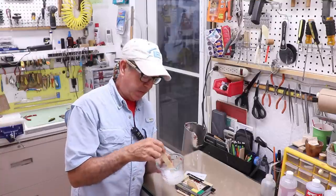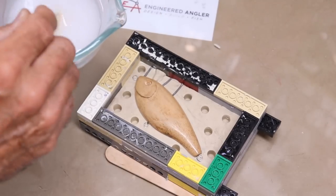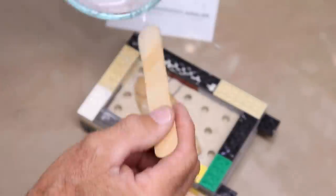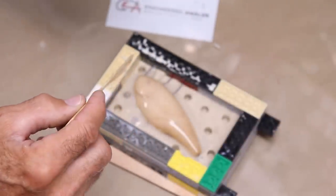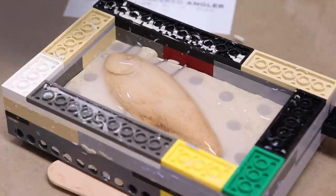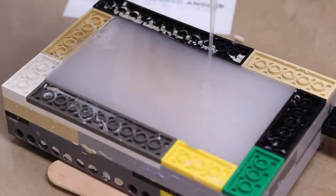Scrape the stick periodically to ensure everything is mixed and avoid any pocket of silicone that won't set. I put links for supplies in my Amazon store — look for that in the description. Have the mold as level as possible. Drizzle a very thin first layer on the body to ensure no trapped air bubbles right on the surface; make sure you fill in any carved details. Give it a couple of minutes for bubbles to surface and pop, fill the alignment divots, then fill the rest by pouring into one corner in a thin stream and letting it flow through. Zero waste.